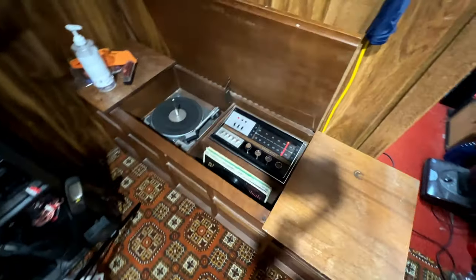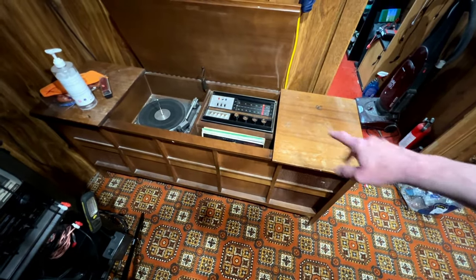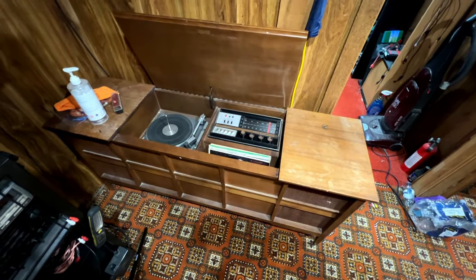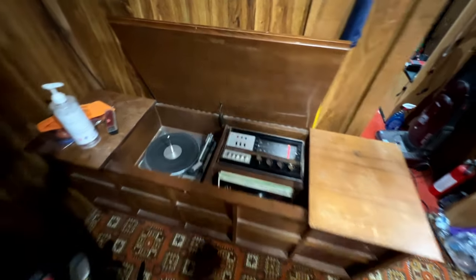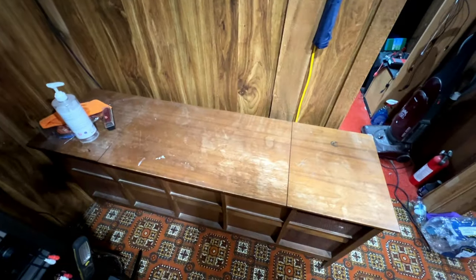And I even got the power indicator on the bottom fixed. That was a bit of a pain because I had to get underneath and re-solder the ground wire to the socket again, but it's working. No problems whatsoever. So let me turn the lights back on here so you can see again. And yeah, it's time to get the speakers done. I'm going to measure for DC offset one more time on both sides and see if it's the same. And if it is, it probably is, we'll just go ahead and do the swap. So let me get you back over to the table and we'll talk speakers for a second.